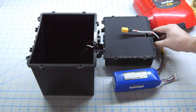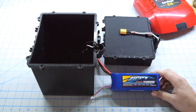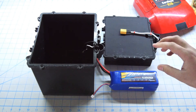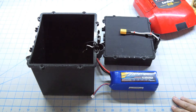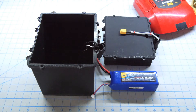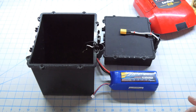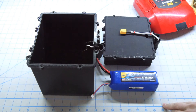Just for notes — this battery is a Zippy 5,000 mAh, 20C, 6S, so it's 22.2 volts nominally. 20C means we're going to get about 100 amps out of this battery, which is actually a little more current than the original lead-acid batteries, but it's obviously quite a bit smaller. Compared to the lead-acid that was in there before, this is actually about the same run time, which was sufficient for my lawn. And unlike the lead-acids that wore down over time giving less and less mowing, this one doesn't degrade nearly as fast. If I had a bigger lawn, I could double up to essentially double the original battery capacity.